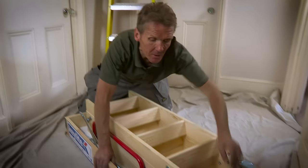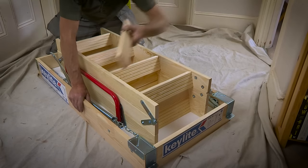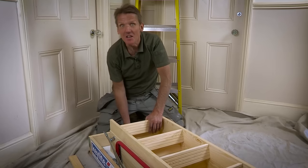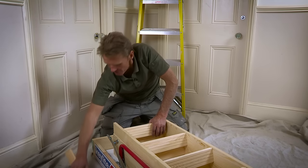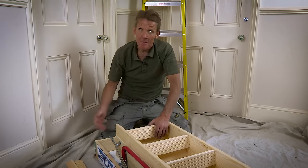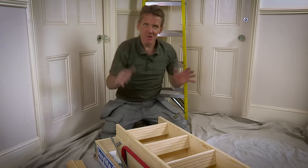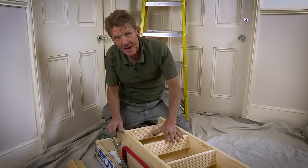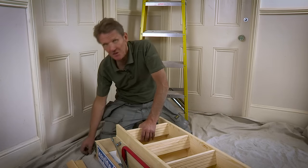Now I've got the wrapper off and I'm going to unpack it. It's important that with these two batons you don't think they're packers and throw them away, because they are integral to the fitting. With this unique flick-fit bracket — you'll see how that works shortly — it allows you to put the unit up very easily into the hatchway. We're going to take the ladder off the hatch to lighten the load; that's another unique feature of this ladder.